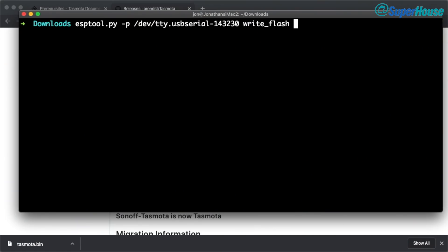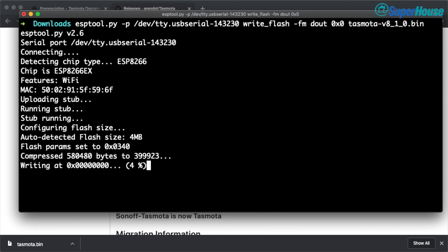For years now, the standard way of installing the Tasmota open source firmware onto a device like a Sonoff or a Wemos D1 Mini for your home automation system has been to use the ESP tool command line utility. It's really powerful and it does a lot of stuff, but it can be a little bit daunting. And it also leaves you with a bit of a problem because even after you've put the binary onto your device, you then have to do that little dance at the end where you power it up and use your computer or phone to connect to its Wi-Fi network, give it your own Wi-Fi config, have it switch back, and then switch your phone back again. It's all a bit of a pain.